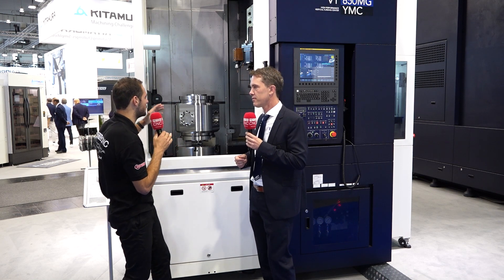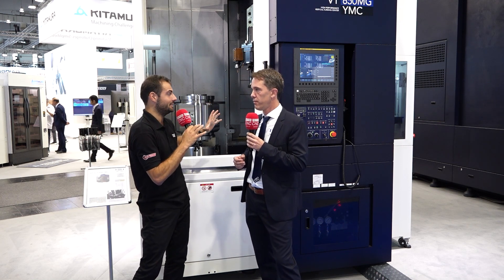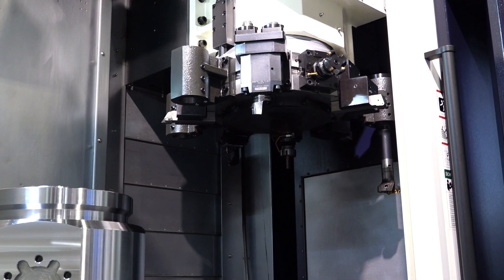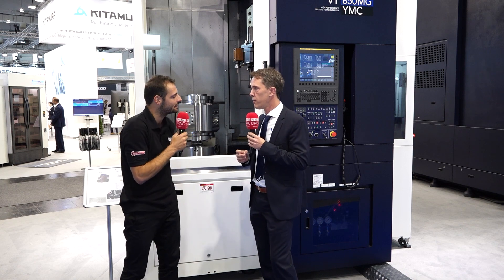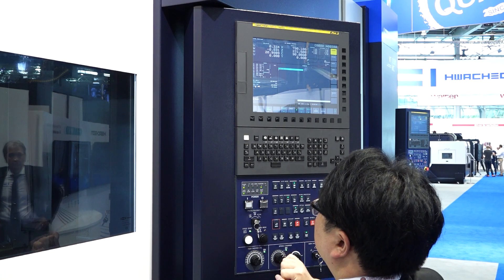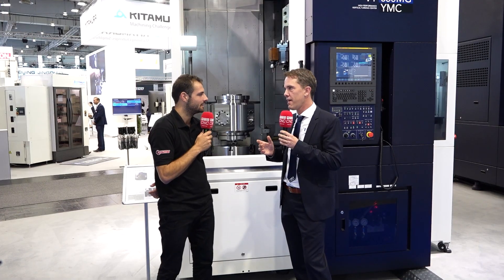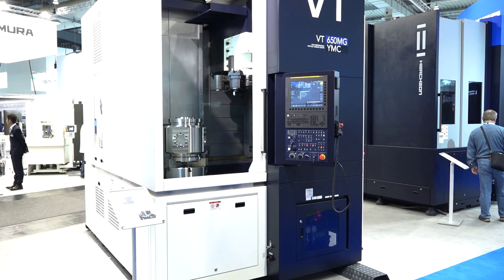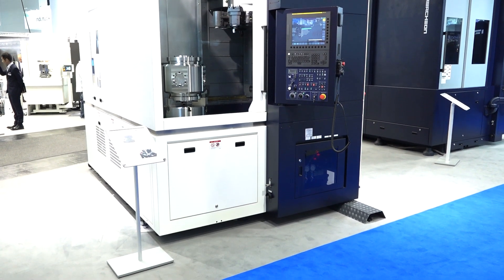In this kind of machine it's more for short, fat parts, is that right? It's not for long shafts — it's for smaller shafts with a larger diameter than height. There's a huge benefit to putting those kinds of components on a machine like this. Imagine you have a part with a diameter of 500 and a height of 200. If you put this in a horizontal lathe, you'd need a crane. You'd have to turn it 90 degrees, whereas here you just put it on the table or the spindle, which is much more convenient for the operator. And of course for automation.